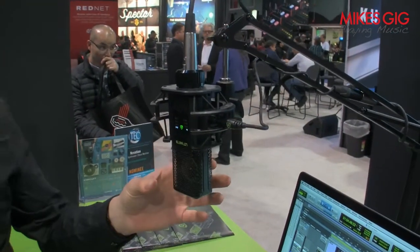Another very interesting feature is our Perfect Match technology. Usually you have tolerances in production — the capsules are not all 100% the same for any microphone. If you want a matched pair, you would need to select different capsules to have the same sensitivity. What we do is use a microcontroller inside the microphone which can control the polarization voltage. During production, we adjust the polarization voltage so that every microphone ever produced from this LCT 640 TS will have exactly the same sensitivity.